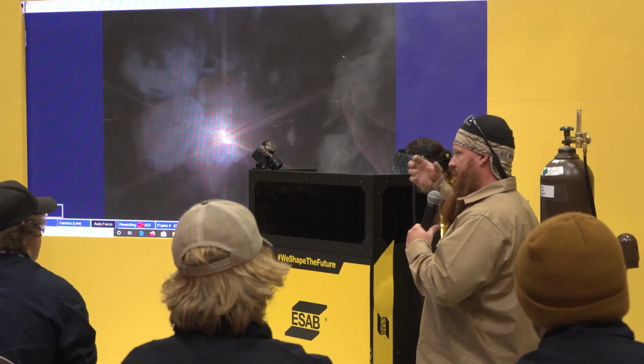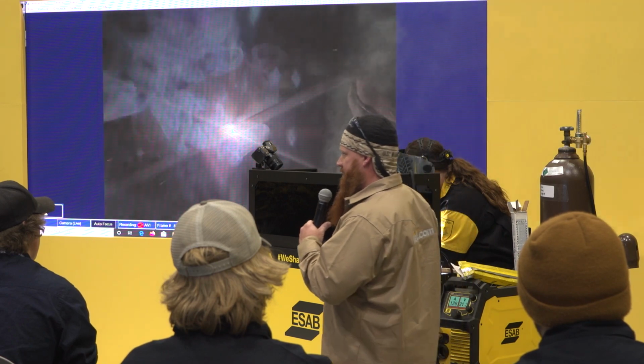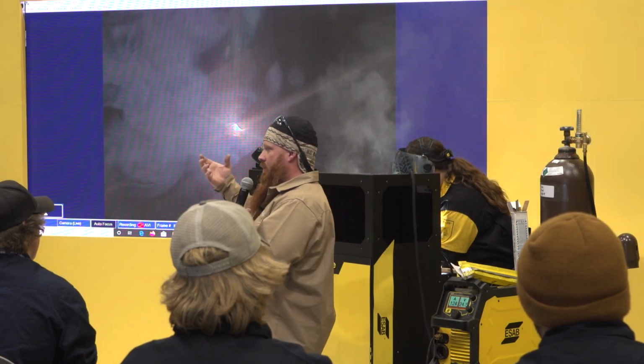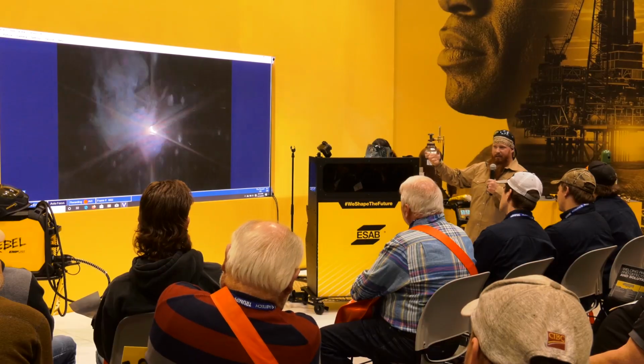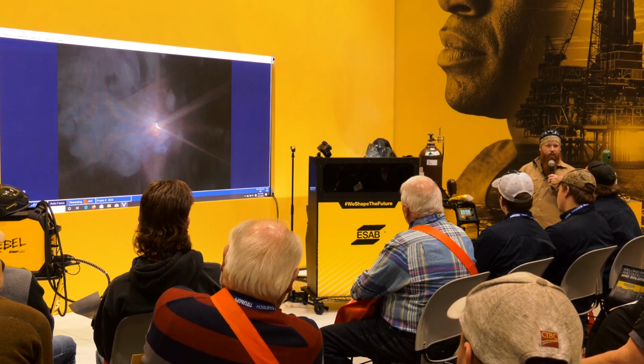But it only happens for about a half to 1.5 seconds. We're just going to jump up and spike a percentage. So let's say you have 10%. You start off with 100 amps, you're going to start off with 110 amps. It's just 10% of whatever you set your machine at. We're just using 100 because everybody can do 10% math, so it's very simple to operate that way.